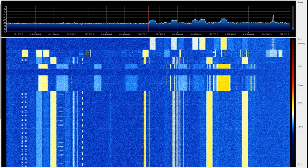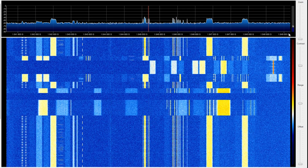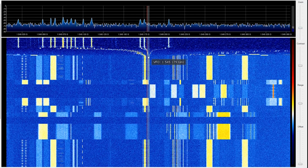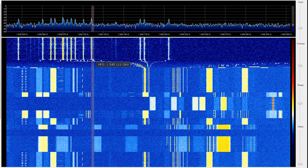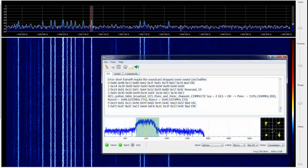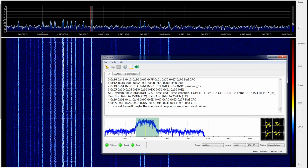Well, it just so happens that this particular antenna has its own built-in low-noise amplifier, and just so happens to run on 12 volts DC instead of the usual 4.5 to 5 volts DC that you may be familiar with using a traditional bias T on your software-defined radio. So rather than using the bias built into the SDR, we're using the 12-volt power injector instead.